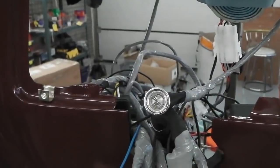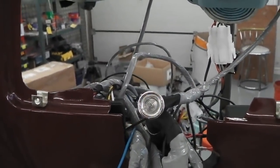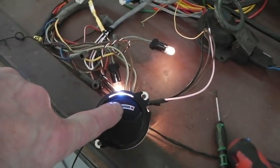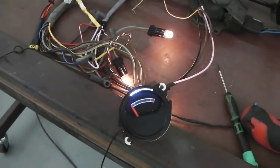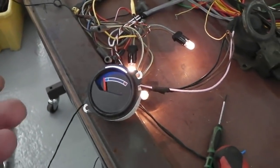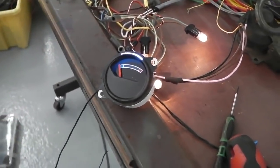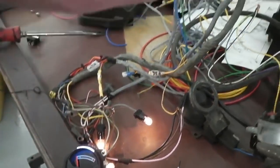But the idea would be it's a pull over light, so it's going to keep on going, because your engine should not have reached that temp. It shows that something's wrong, and it saves you in time before it actually gets to a boil position, so you can monitor it, and you may reset your journey. You might find it was the fan had failed, your stat's jammed shut, you're low on water, you're just a very, very hot day, a freak hot weather day, whatever it is. This will warn you of it and lock on.